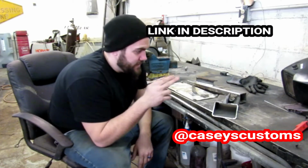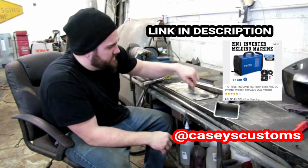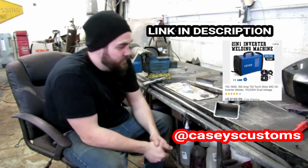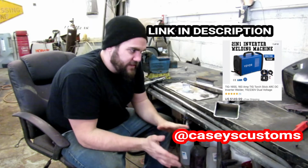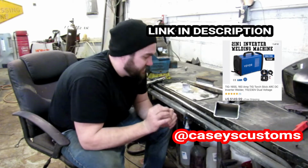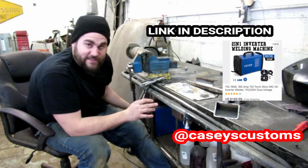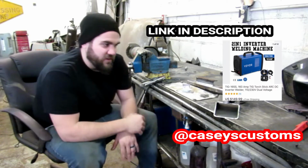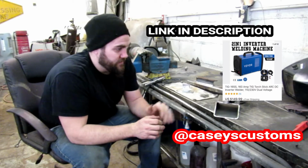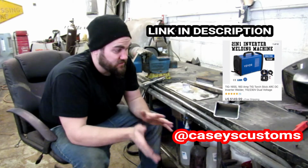So we did 3/8 inch plate, we did 1/8 inch plate, and then we did 18 gauge sheet metal. It really did perfect on all of them, which is just amazing. Thinner stuff, you really got to get your gauges, your heat settings and stuff set. If that's off, you can just burn right through it. When it comes to the 3/8 inch plate, you don't have to be as exact. So I've noticed that helps.